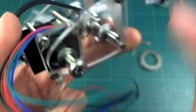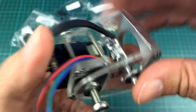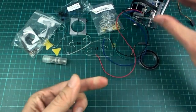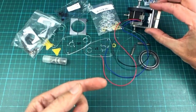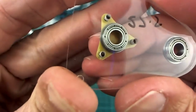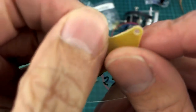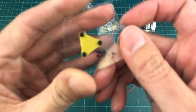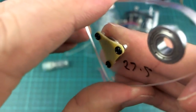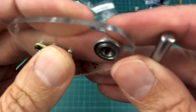at the moment, but for the final thing, to stop it from sliding in and out, I've made one that's the exact right length for this, so that's going to fit exactly in that left to right distance. And I've made these little stopper things out of FR4, just a little piece of that, nice and light and stiff, and I'm just going to screw those across the top of the bearing. These bearings are flanged bearings, so they're really quite handy for this purpose actually, if I can just focus.